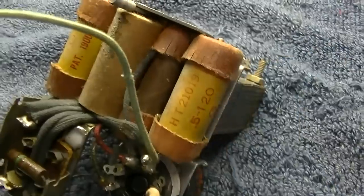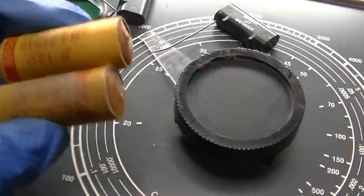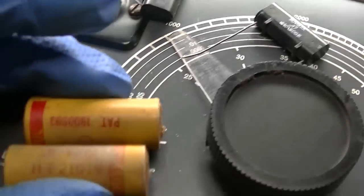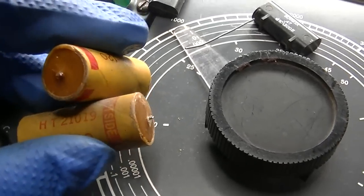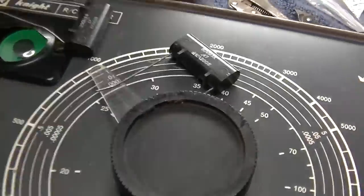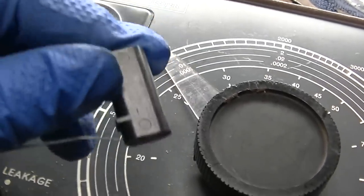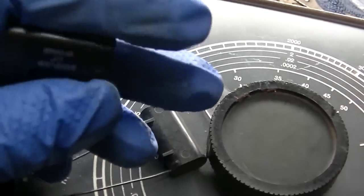These cardboard caps are both very leaky. In fact, at 50 volts they hold the eye closed, and they're way off value - measuring more like 1 microfarad, and the eye barely opens. Not that they would show leakage at 6 volts, because that's what these are connected to. I got these replacements and they're dead on - perfect. Outside foil - I don't think I'm going to take the time to do that, since this thing is sealed in a solid metal enclosure.